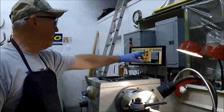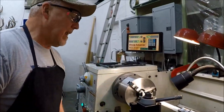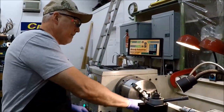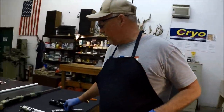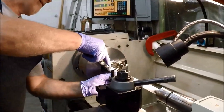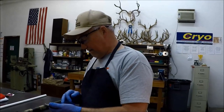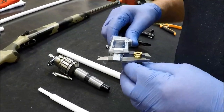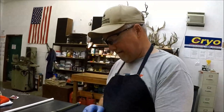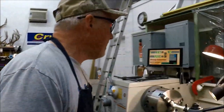We're at 37 — I'm going to zero again. This next pass will probably be the last one, and I would like it to be right. Measure twice, cut once. We are right at 490 minus 469 equals 21. It was dead on — 21 thou on this last pass. I'll keep off my Z-axis, go in 21 thou below my established zero, deeper. I'm going to zero it — that's important for later. I'm going to run it back to my established Z-zero.